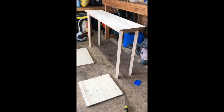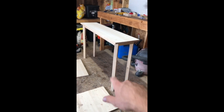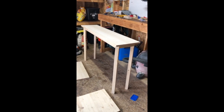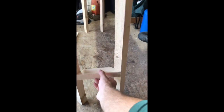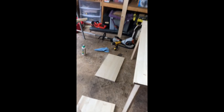Got it assembled now. I've got to take those corner brackets off, sand the top of the leg base until it's flush, add glue to that surface, put the tabletop back on, and re-secure those corner brackets. I think I'll also go get a couple more corner brackets given how long the tabletop actually is — I don't want gaps over time. I'm also going to put lower cross braces on here to pull the legs in, and a beam going lengthwise down the middle so it's supported and aesthetically nice.